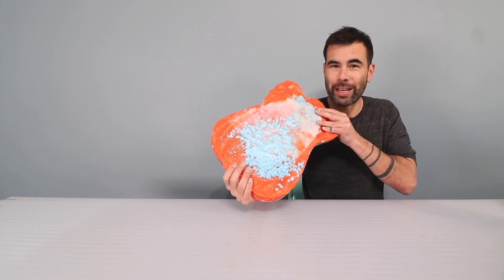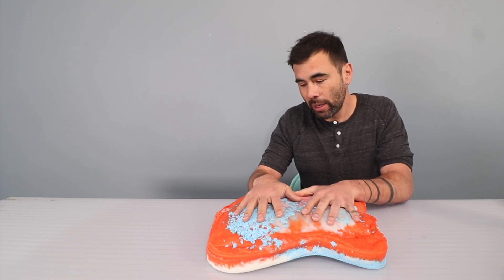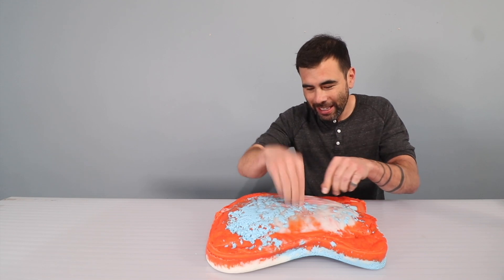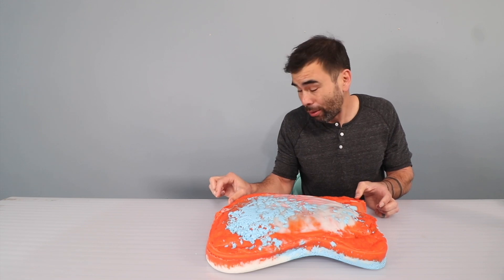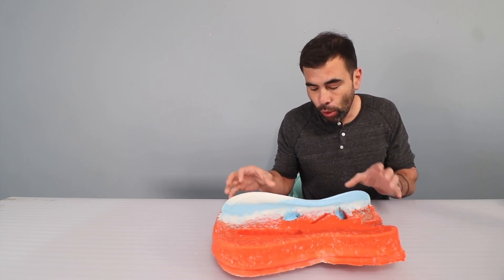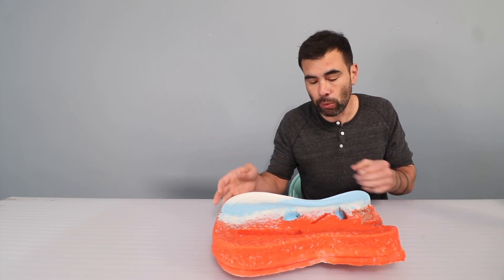This is the first blank that I made, and I didn't use this one because it shrank a lot around the edges. I didn't put that much pressure or weight on the top, and so as it cooled, the plastic pulled away from the edges and rose up in the middle. So it's really thick in the center, and then it gets thinner towards the edges, and it shrank about half an inch all the way around. In the future I really do think oversized steel molds that I could then machine down would probably be a better bet than a semi-flexible mold like the one that I used.